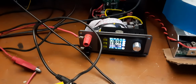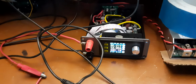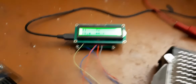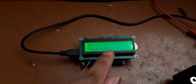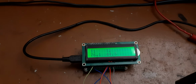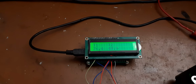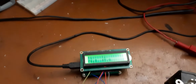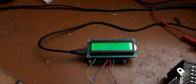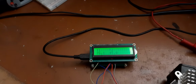So let us see if we can push to 400 watts. According to the datasheet, you can push it to 400 watts if you monitor this temperature and maintain it at just 25 degrees Celsius. It is not possible even with this type of heat sink. You got to go for liquid cooling, coolant cooling. Then it might be helpful. Maybe with a radiator and a coolant, but it would increase the hardware.